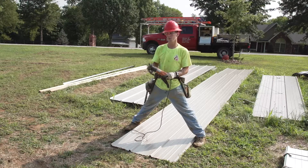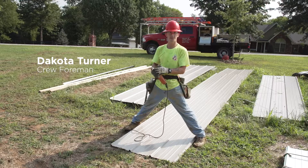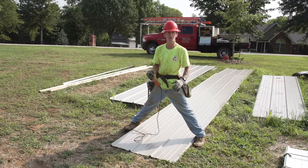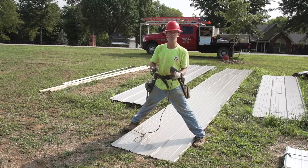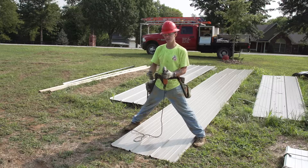The nibbler is one of our most valuable cutting tools. It operates by a fast-moving piston that punches a small semi-circle hole out of the steel as you traverse the sheet. It's very good for cutting over ribs, good for cutting curves — it'll cut anything. There are situations where another tool would be better, but it's highly versatile.